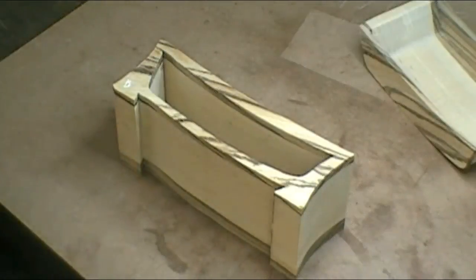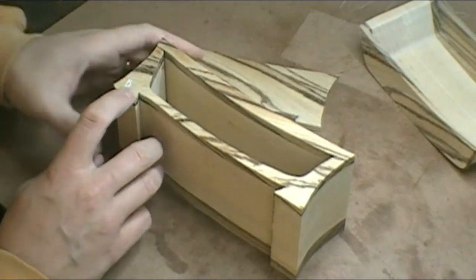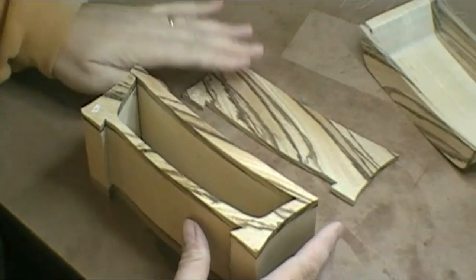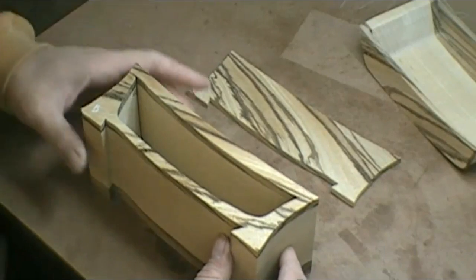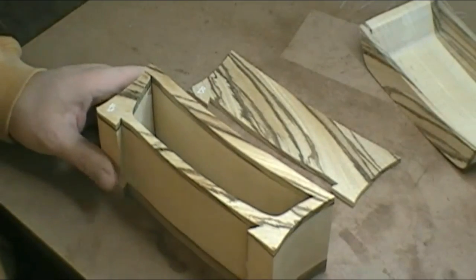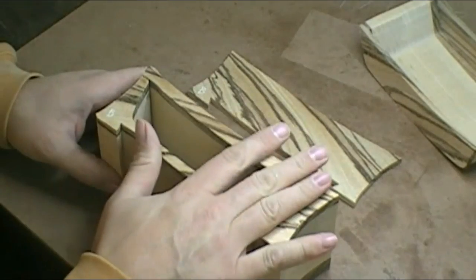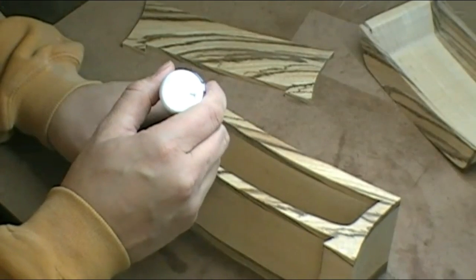Okay, we're back here. I've got it all sanded down, sanded my back. I put my label with a little letter, see if you can see it, B for back here, and B on this part here, which will be the backing to the entire box. Alright, so what we're going to do now is get another bead of glue on here. We're going to get the back on, and then we're going to get the drawer in there, sand the outside, and then figure out what we're going to do for a drawer pull. So we get our bead of glue on there again,